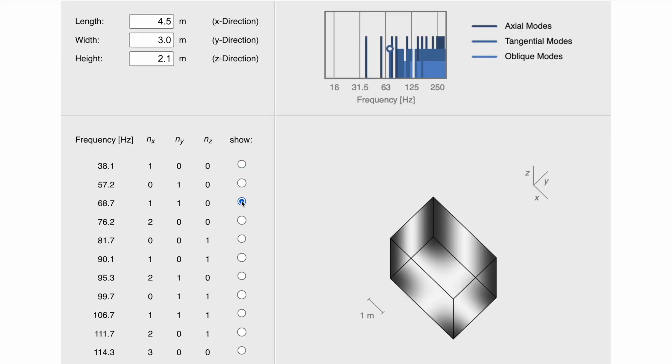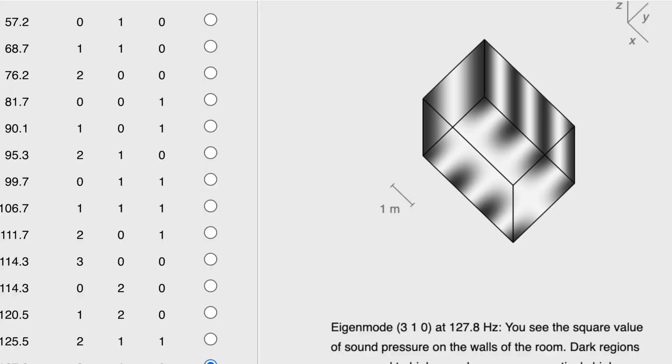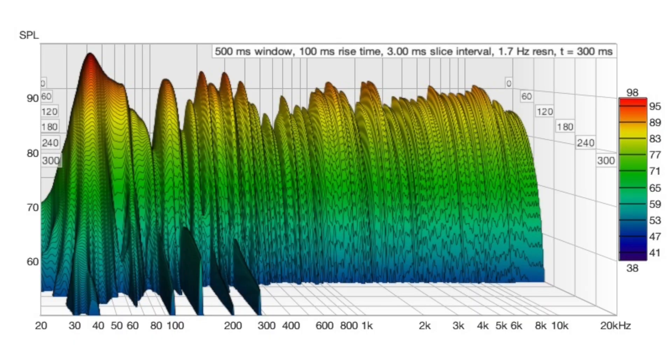The problem we all have is that to effectively soundproof a room, we need to trap all the acoustic energy so it doesn't escape. But all this trapped energy creates axial, tangential, and oblique reflections within the room, resulting in peaks and nulls that interact at different frequencies in different places, causing further problems inside the room. It's a nightmare, and the reality is everything is a compromise. Even a difference in materials on either side of your room can cause a different acoustic problem — for example, there's a door on the left side of my studio that causes the 100 hertz null in my left speaker to be worse. However, with all these problems and the solutions I've imposed, I do now have the room sounding better than ever, and actually better than a lot of studios I've been in.